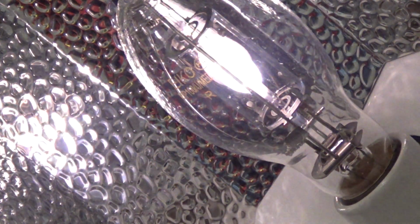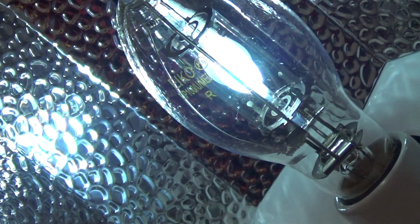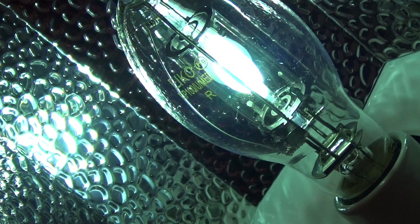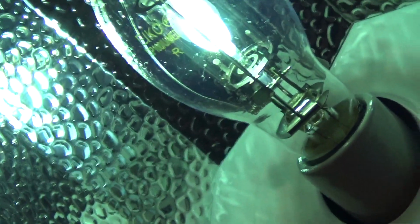See if we get a good start up here of the bulb, which is the metal halide bulb with mercury, as most of the good lighting sources have. I'll plug it into the kilowatt meter just for curiosity's sake. Drawing 3 amps, which is way too much power for this room. 55 watts, power factor of 0.14. That is abysmal.